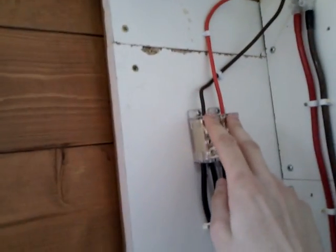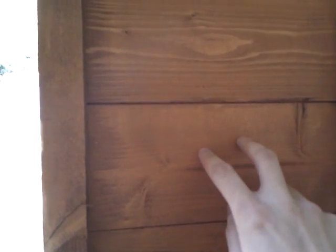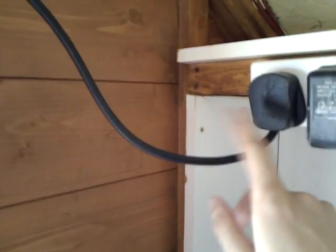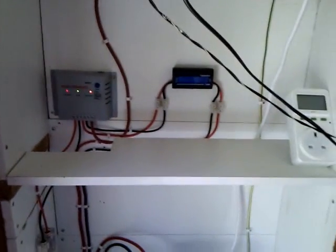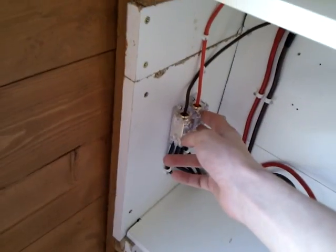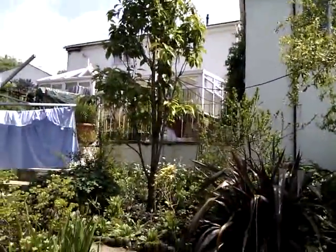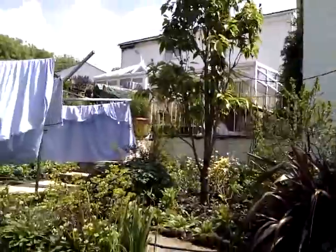And then as a kind of separate project, from this point here where the solar panels come in, I'm going to take two wires over into a little switched junction box and into a grid tie inverter. That's going to be plugging into the grid tie inverter and going straight into the house wiring. So on a day like today, if we've got more power coming in than we're actually using, I can just come down to the shed, flick a switch, and all the power from the panels, instead of being wasted, will go into the grid tie inverter and up into the house - nice and safely. At the moment it's a little bit of a bodge just using an extension lead on a separate circuit, but at the end of the day it's still free power.